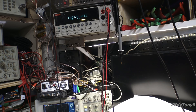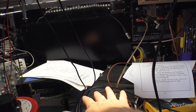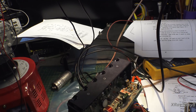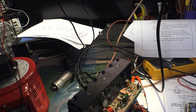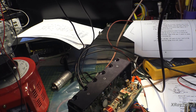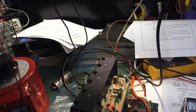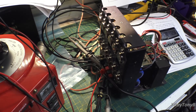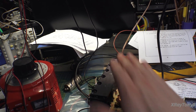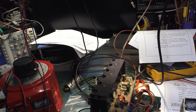I'll do a little burn-in on it for a while to make sure everything's good. After putting out that full power, I can feel the heat sink is just a little bit warm — you can feel it warm to the touch, not hot or anything. But good grief, we were dissipating 406 watts on something with essentially no heat sink, just this little plate of aluminum. It almost looks ridiculous looking at all these big transistors connected in here. Maybe we'll try to explain a little bit why this works the way it does and give you a little bit of theory on that.